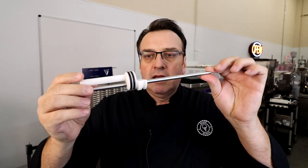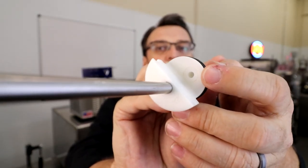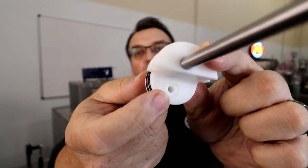Whether it's a frozen dessert like soft serve, frozen custard, or frozen beverage, I've got some examples here. This is the flow valve from a Stoelting soft serve machine, and you'll see right here — focus in — that little opening there is the opening by which your ice cream mix, soft serve mix, or frozen yogurt mix flows from the hopper down through this valve and into the freezing cylinder. Now if you're putting anything in that hopper that is bigger than that hole — any flavor profile that has pulp, particulates, or seeds — you've got to be aware that if you block that flow hole, that flow control hole right there...